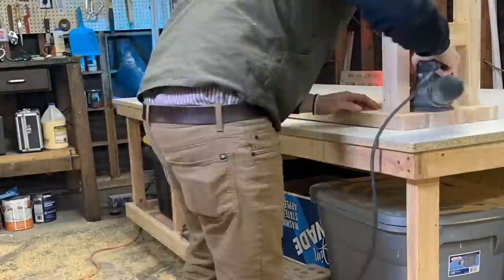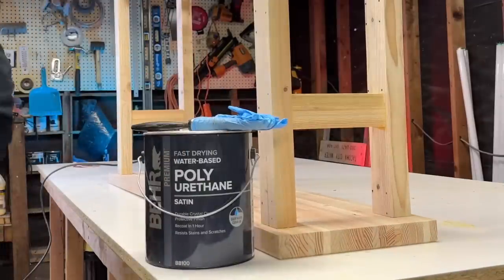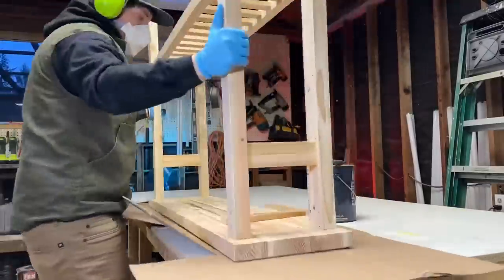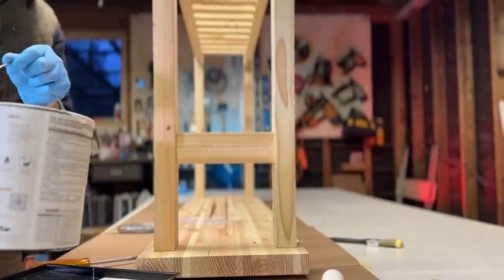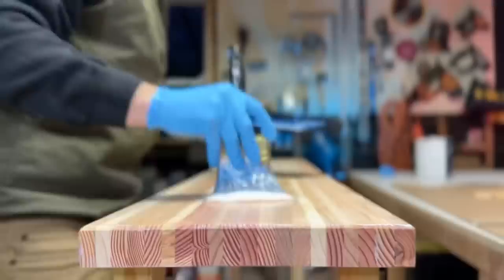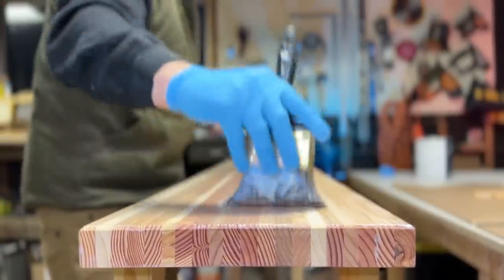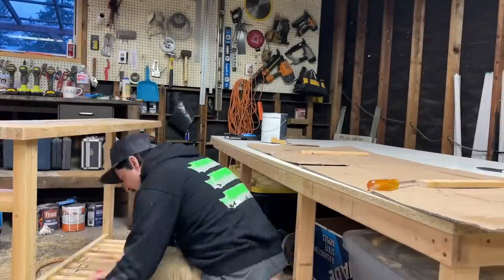The cracks sealed up, and now all there's left to do is sand and finish. I really like this water-based polyurethane product from Behr — I have it in a satin finish. I really like the way it protects the wood but leaves it feeling nice and natural. This stuff dries really fast so I can apply a second coat within an hour or two, and it's not as potent-smelling as oil or latex-based products. I'm not sponsored by Behr, but I really like this product. I tend to steer towards water-based products unless I'm doing an outdoor piece.